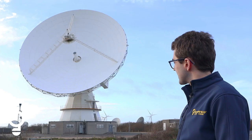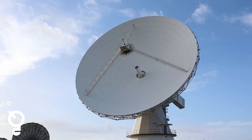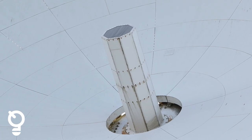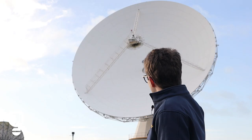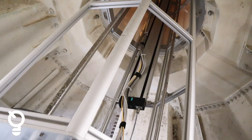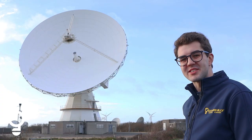The way that spacecraft signals are received by this antenna is that the spacecraft radiates, hits the main reflector, it's reflected back up onto the sub-reflector, and that is then reflected back down into that tower structure you see protruding from the dish. Behind that is the antenna's feed, connected to the cryostat and the sensitive receiver which receives the signal and decodes and demodulates it.